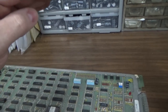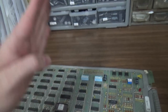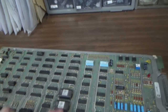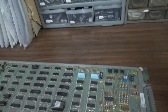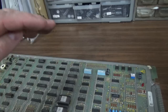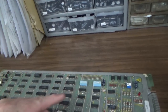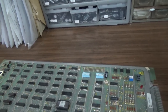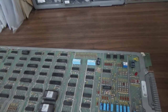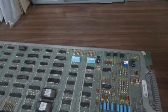The reason that it won't work right if it's below 5 is, let's say it's at 4.5. The chip is sending a signal, digital information, between the chips, but it never gets up to 5, so it never gets to really a high state, so the chip can't really interpret it as high. It sees the signal coming in, but it's never going all the way to 5. To that chip, that signal might as well just be a flat ground. So your 5 volt has to be about right. You need to be at 4.9 or so up to 5.1 or so. The closer to 5 you can get it, the better.